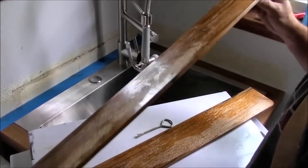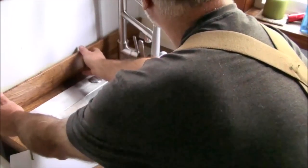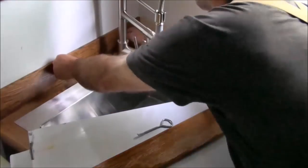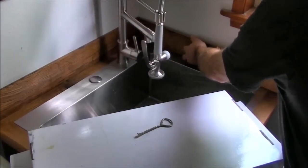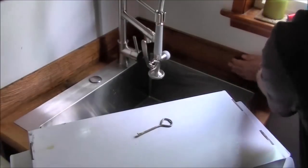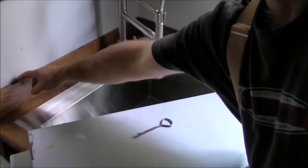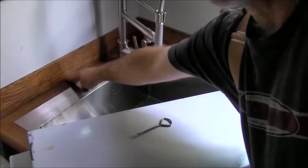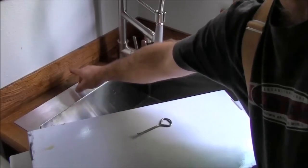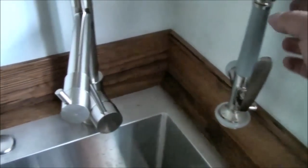The panel's glued up — the glue has gotten tacky. Remove the tape, press into place, and voila, we're finished. What I could do is go back behind here and take a little bit of clear silicone and put a real fine bead around the contact points — the intersecting points of where the cabinet meets the backsplash — and seal that in.